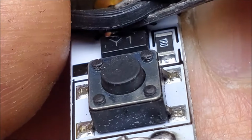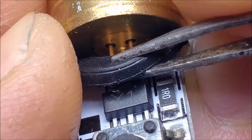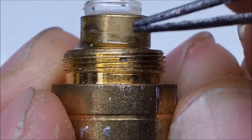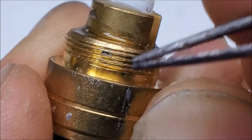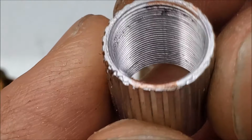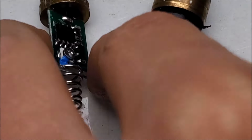Though we already have a couple of reductions. So one capacitor has been removed, potentiometer has been changed. Looks like we lost an inductor. There's no retaining ring, and where it used to be copper brass here on the outside, it's now aluminum with this weird splining on it. So that's where some of the cost savings have come in from 1995 to 2015.